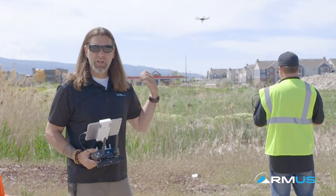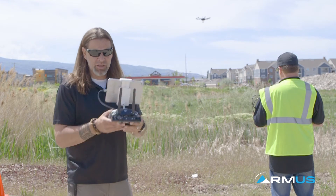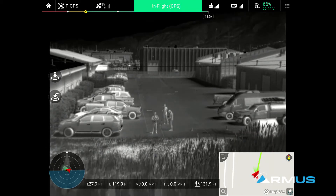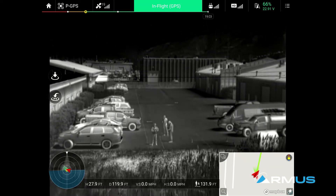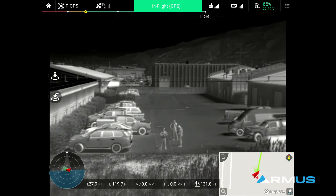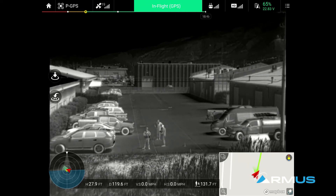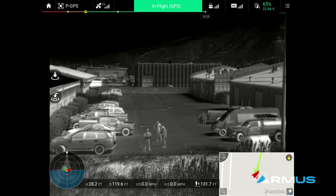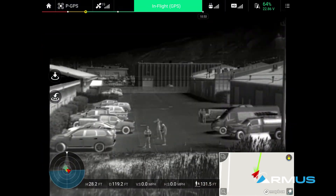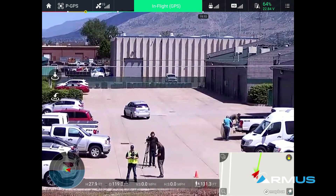During this configuration, we went ahead and set this up on the M600. We've got it up in the air right now. We'll show a couple of things as far as what the app sees and the things I can do to the camera and gimbal in this configuration. As we move around, we can move the gimbal up and down — that's on one of the dials — and we can move the gimbal left and right, also on one of the dials. The audible beeping noise tells us that the gimbal is in its dead center spot. Some of the other things configured on the PWM outputs include changing between picture-in-picture, thermal, and full RGB — we have all that configured on this setup.